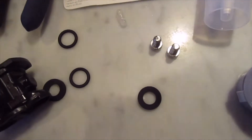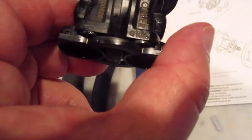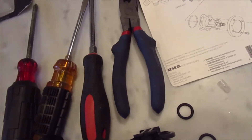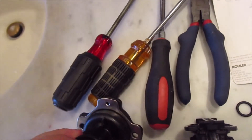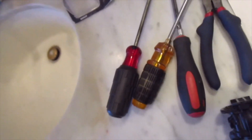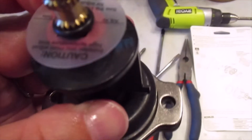I've just looked at this unit and pre-lubed it. I put the O-rings over here. If you look at the instructions, you'll see it says 'cold' right there. So this is the cold side when going in, meaning this is going to be on top. Another important thing you need to know is which side is the top on your mixer valve. The easiest way to tell is by this big piece right here — it's called a stop. That stop prevents the valve from over-traveling because there is an Allen screw right there. Turn it until it stops — that would be the valve completely open with hot water blasting.